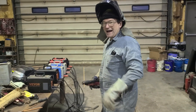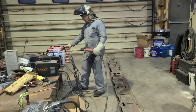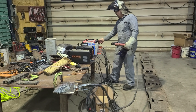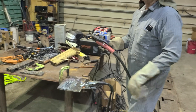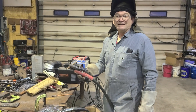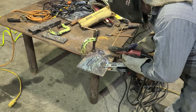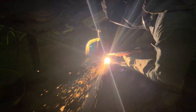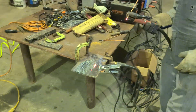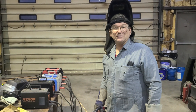It can do it, sort of. Not happy — you wouldn't like it. But it actually wasn't too bad at the lower setting with both of them running. Let me try that again. Two machines, 80 amps each — though I think they're lying; I think it's putting out closer to 85 or 90 from the way it welded. That's actually a practical machine you can do carbon arcing with out in the field. It's surprising you can do that with two 110 welders.